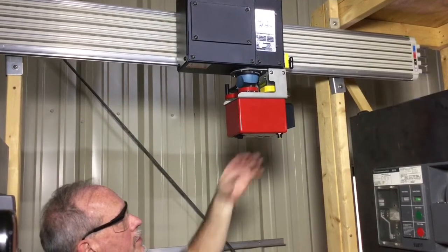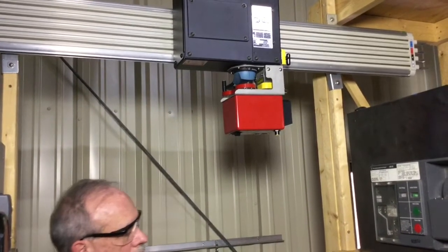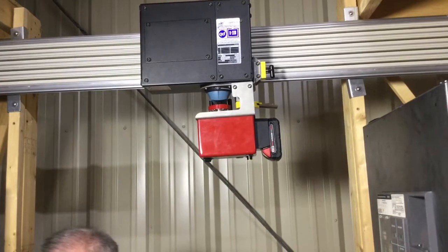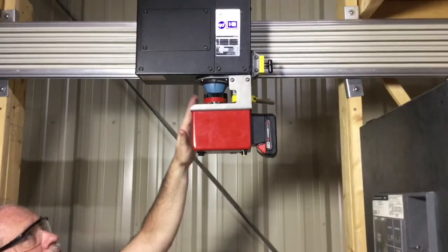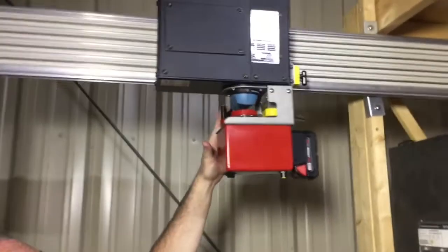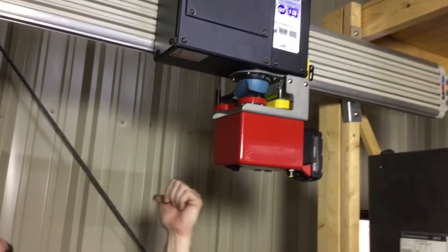We've got some buttons and switches here on the bottom and a cable we need to hook up. I'm going to go ahead and put the battery in. It uses a Milwaukee M18 battery, lithium rechargeable. It slides up and locks into place. There's a switch on it that you have to set depending on which position off is. In this situation, the handle's already in the off position, so you see where it's located. The switch has to be set in the direction that the handle will be.